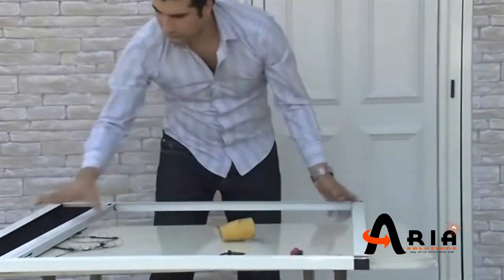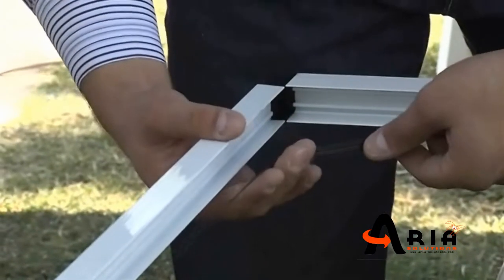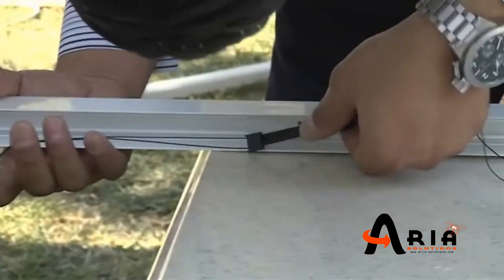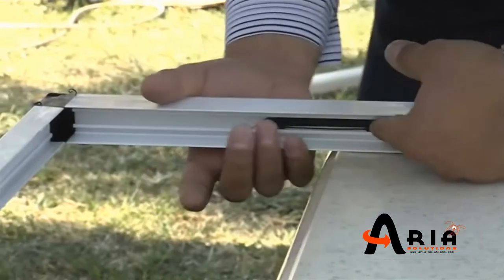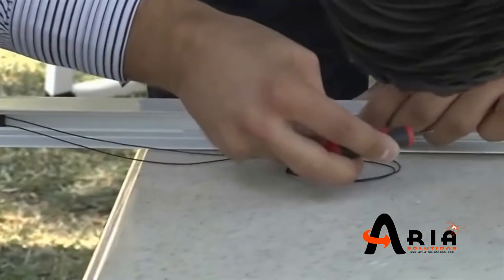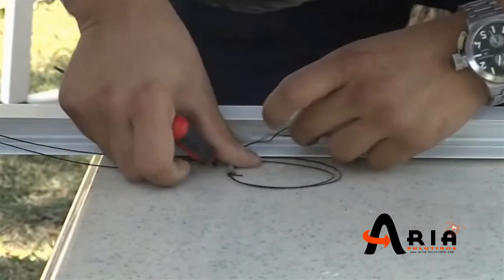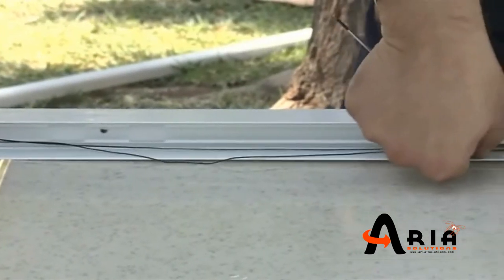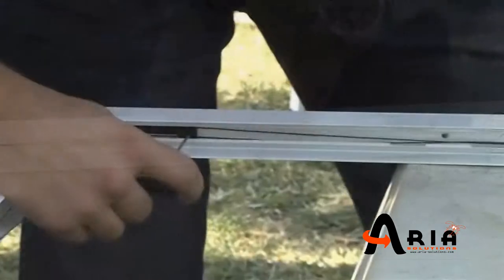The smooth movement of the system is maintained by the cords. For this reason, make sure that the cords are parallel to each other. The big cord carrier has to be slid on the top and on the bottom of the side profile. The small tensioner has to be tensioned in the opposite direction and fixed by using the set screws. The system works hard when we increase the tension and works smoother when we loosen the tension of the cords.